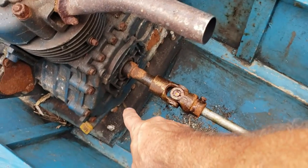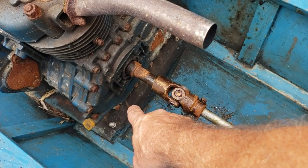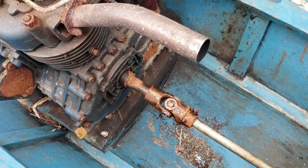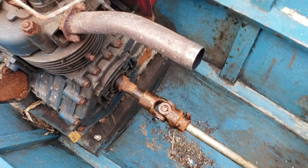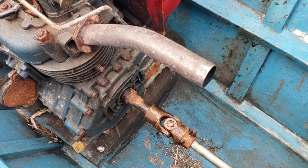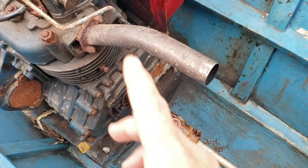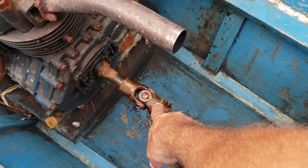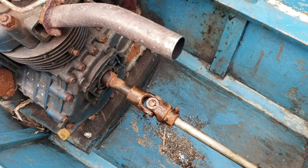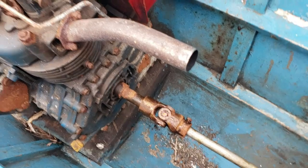I know that Ty Ty went out and changed that bottom plate, or readjusted something the engine mounts on. If it was not set for this size engine to start with — you all had that smaller gas motor — and that level is wrong up and down, even though yes the cross joint can flex, if these angles are not just perfect it will bind up.